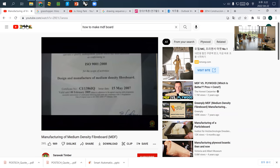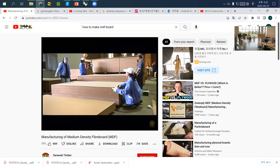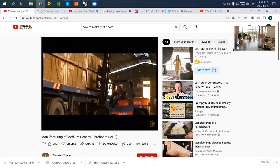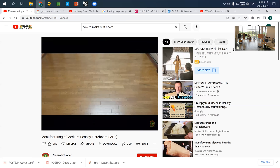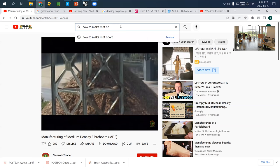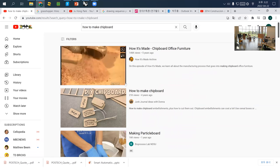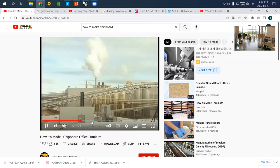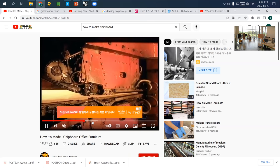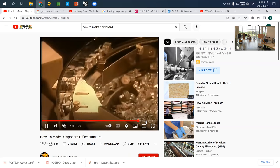But one of the bad things, and actually all the furniture you can buy these days is made out of this. That's why all our children have skin problems, because this has a lot of glue inside. This one is almost powder-level wood chips, but there's another, so-called chipboard. Chipboard is slightly bigger than powder. It's still the same process. You prepare wood chips first, but roughly ground instead of finely ground. They combine it with glue and press it, and then make this kind of particle board.